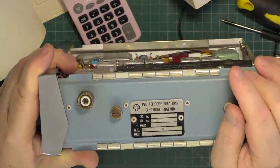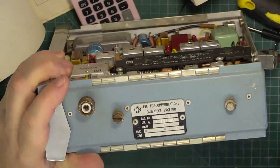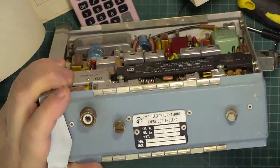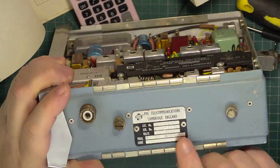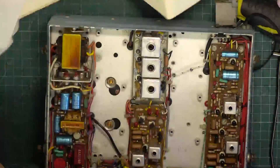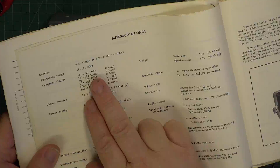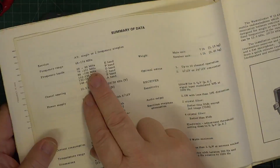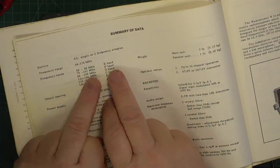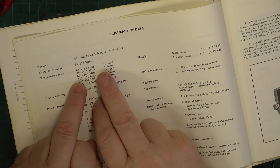It's not a sticker - it's a riveted-on plate that tells us it's 12.5 kHz spacing and single channel, manufactured in 1986. In my experience it's very, very rare to have back-to-back two and five watts. Normally on a UK general firm, radio is used for a car to talk back to base. You radio through to base and say 'can you cut and pick these people up, I don't know where this address is.' Then base will call car 17 - 'go down Wally Street' - so it's passed on. It's quicker that way. It's base-to-mobile, not mobile-to-mobile.